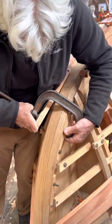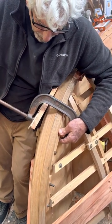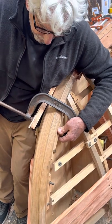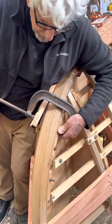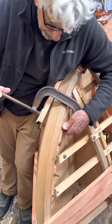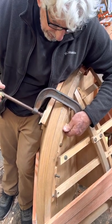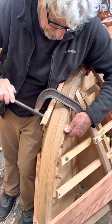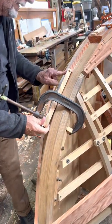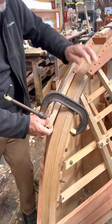Have the pad — as you put pressure on this it's going to pull it in, but you have to watch it doesn't jump off. Now it's going to get the final amount I need before I come in all the way. I go slowly here. It's a drag when they crack, because when you're doing a nib job like this you have to start over. So you have to be sure it didn't get trapped here — which it didn't.